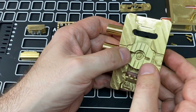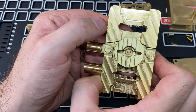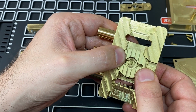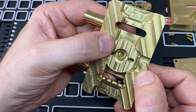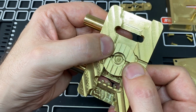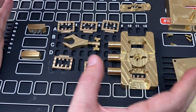I think that having to tension it by really sliding the whole quite heavy and well machined cassette all the way to one side, and then try to pick yourself out of these false gates on top and bottom and all 3 wafers, even if you know the bitting, just seems like a challenge that I probably wouldn't have the skill to surmount. So while you can't get one of these locks yourself, they are all sold out or been given away.